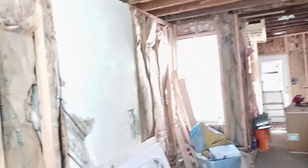Moving the wall could have a negative effect because it's now taking the load down these joists through the studded wall, and we'd need to see how that load transfers to the foundation. We have floor joists here, and being so close to the edge might actually negate the issue. We've got about five inches before picking up the load bearing edge, then about four studs — not directly underneath each one. The shims look decorative, just bringing the wall out even with the fireplace in these old buildings.